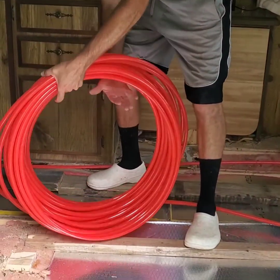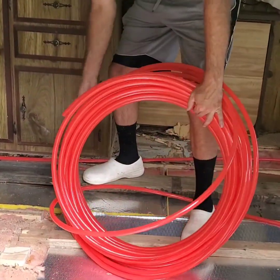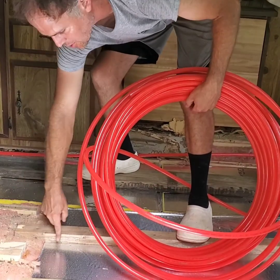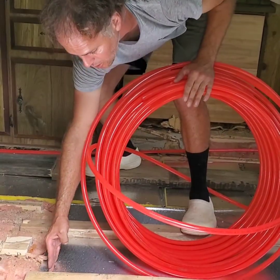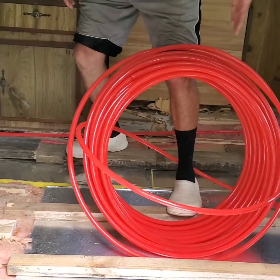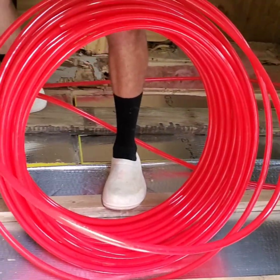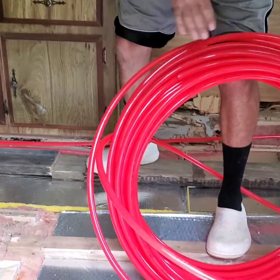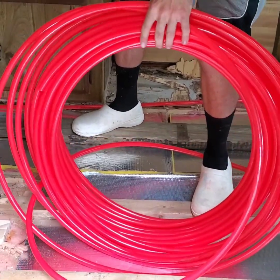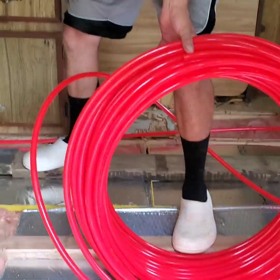Now that the floor is torn out, we're going to wrap a bunch of pipe and run it between the floor joists. We left spots to bring the pipe in and around. The main beam stops right here so it's still supported, with main beams under each spot. This reflective insulation will make the heat come up — if you're in the sun you can actually feel it with your hand. It's super bright and very hot; these guys had to put it in the shade because it got so bright and hot. That's how reflective it is, so it'll increase the efficiency a lot.